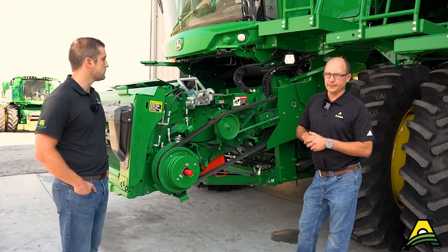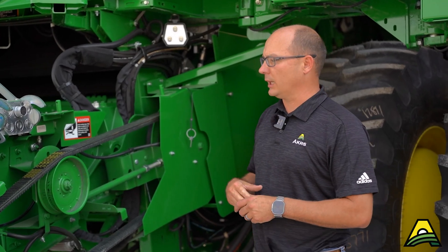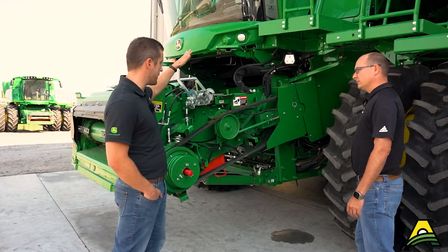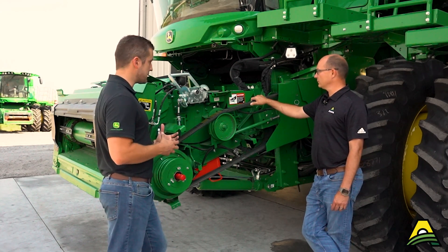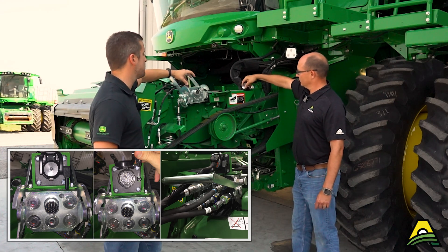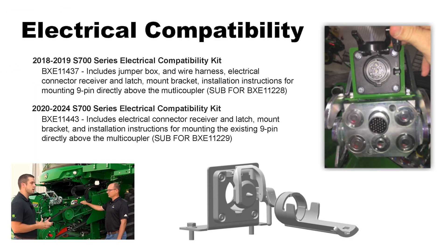That can be kind of a pain when you're going through harvesting - you can be processing the stalks really well, next thing you know you look and you have a lot of tall stalks because your feeder house slowed down without you noticing. Since we're talking about the multi-coupler or single point, it's a good idea anytime you switch heads to keep this clean, both on the combine side and on the header side. Some of these newer heads are starting to come with a nine-pin connector like you're seeing on the X9, so there are kits depending on which headers you're running - to run the 31-pin or the nine-pin. On newer machines it's just tucked right back there, and you can mount one or the other to go back and forth.